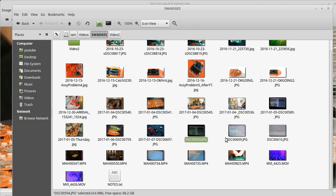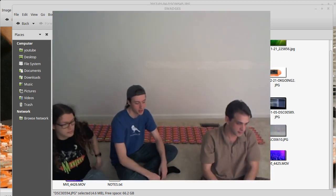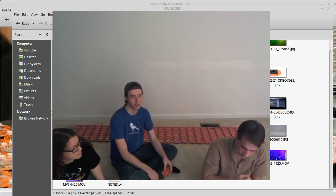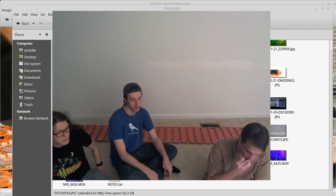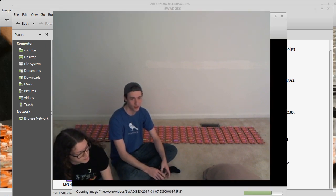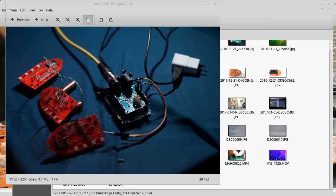One of the cool applications for these badges was during concerts. We have a guy on the lighting board doing all kinds of fancy things on stage, and then 2,000 of our attendees have one of these badges hanging around their neck. So I built a little DMX interface. Initially we had that sending over the network to our centralized server, which would then unicast color changes out to each of the badges in the concert hall.